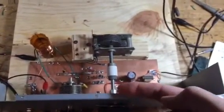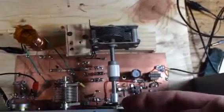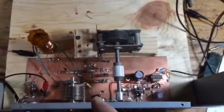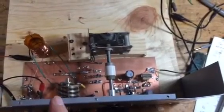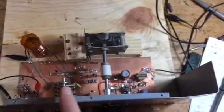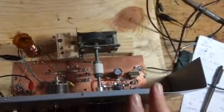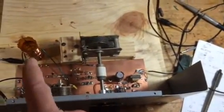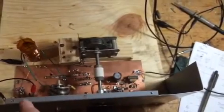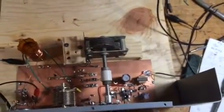A total of four transistors in this whole thing: there's a little RF amp, there's the detector, and there's two AF amplifiers. There's the pill bottle coil, and that's basically it.